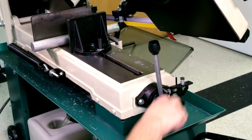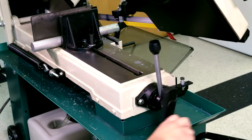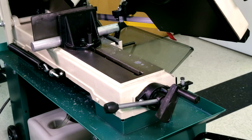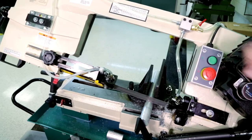The workpiece must be held securely in the machine's vise. Rotate the handle to position the movable jaw near the workpiece. Then, press the clamping handle downward until a firm pressure is felt. If the handle reaches the end stop before tightening, the movable jaw position needs to be adjusted.